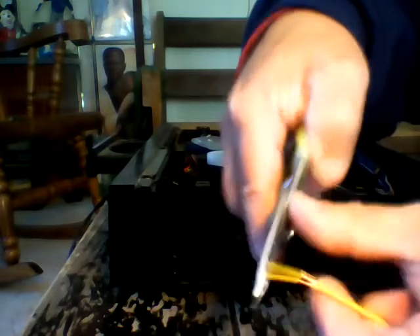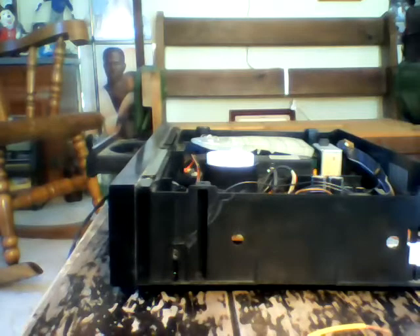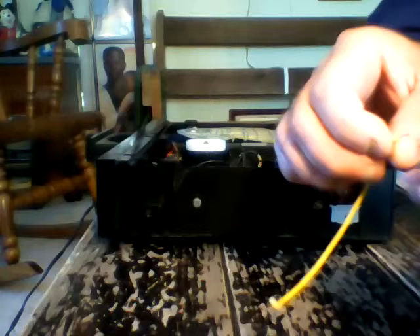I'm going to strip it. Here is the fuse block I'm going to be putting in. I'm going to be putting it on facing down. It's going to be on this side, so I'm going to go in the hole, come down with all my strands, and make a nice tight wrap.